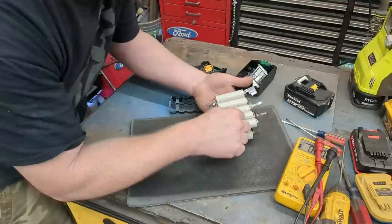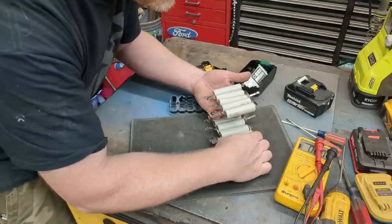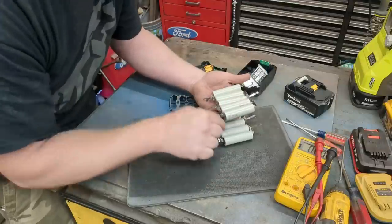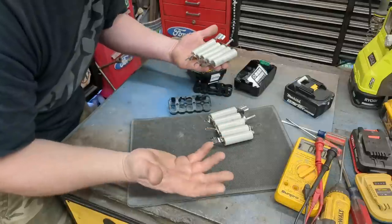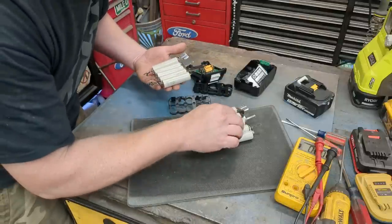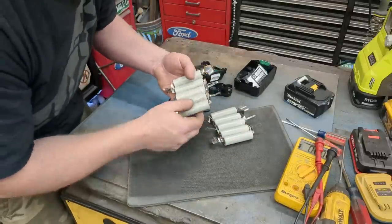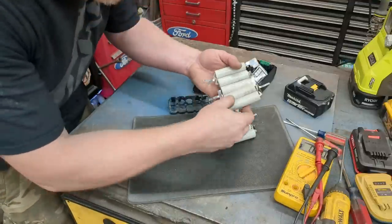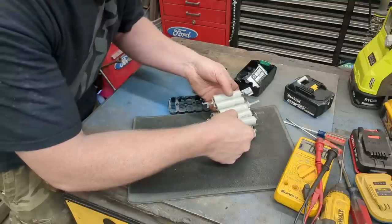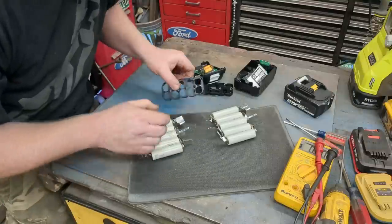not charged at all, this cell just by itself is going to charge this cell, and it's going to dump a ton of amps, and you could overheat it. So I want to get them as close as possible. I think these are 3.7 volts or 3.71, and these are like 3.75. They're really close. So just double check. There's my negative. So my pack is going to go like this in the setup in here.